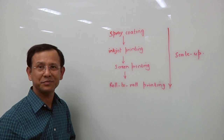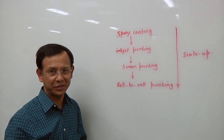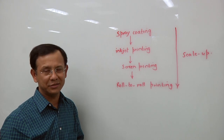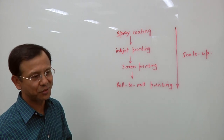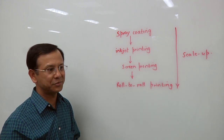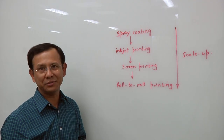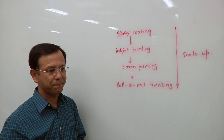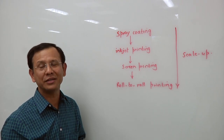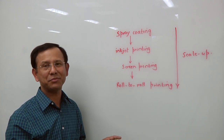You can mix and match a lot of different kinds of sensors with this technology as well, right? So it's not just temperature — it's also pressure, vibration, all sorts of things. The beauty of printed sensors is you can have different kinds of pixels on your sensor array that give sensitivity to different environmental parameters like temperature, moisture, or any other gases, including poisonous or toxic gases. So you can have a sensor array with different pixels with different functionalities.